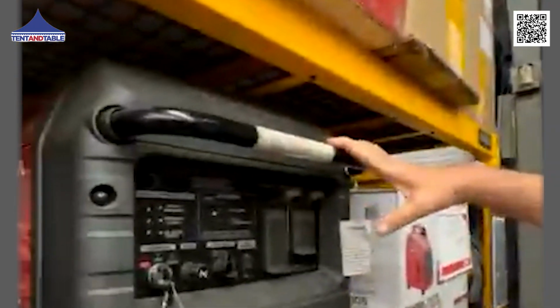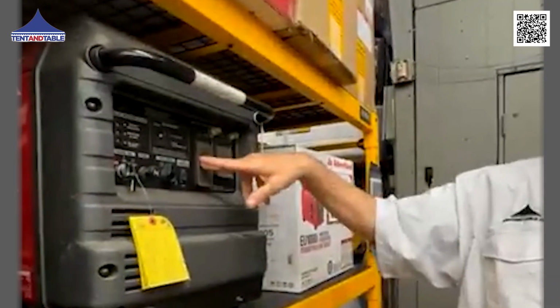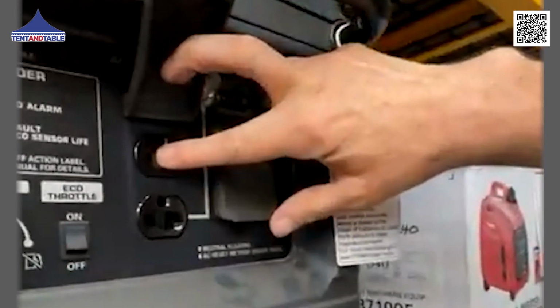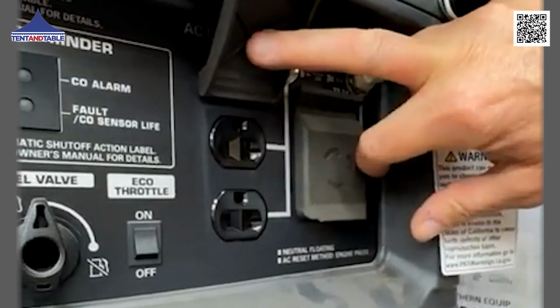So even when you get into some of the larger inverters, they're making inverters out there now that are 6,000 watt, 7,000 watt. A 6,000 watt inverter might have 2 duplex receptacles, but that's only 2 blowers. Again, one motor driven unit off of one side of the receptacle.